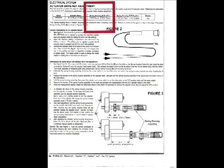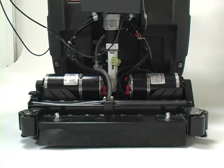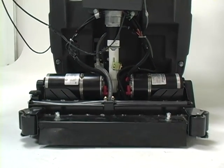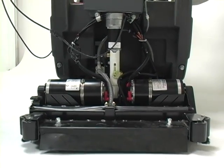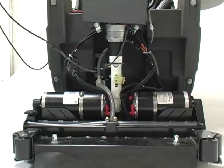These dimensions are listed in your service manual in the electrical section. Because of things like normal manufacturing tolerances, wear and tear on the machine, and differences in deck weight, you may also need to adjust the travel limits slightly once you've installed the actuator into the machine to make sure the attached equipment is moving to the correct positions when all the way up and down.